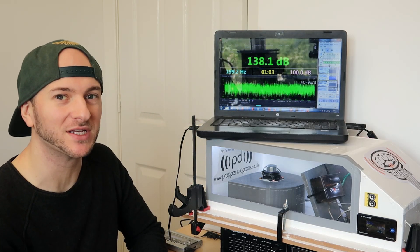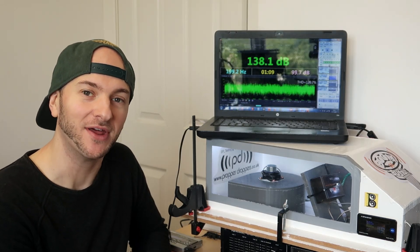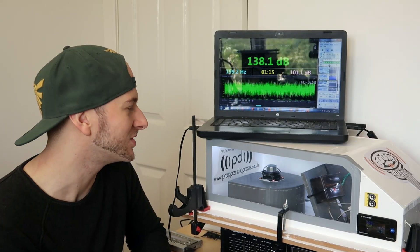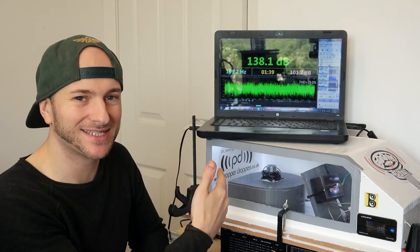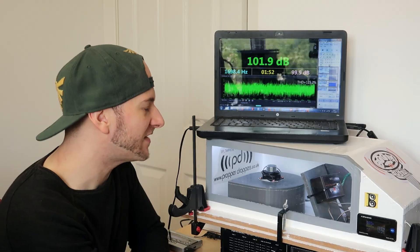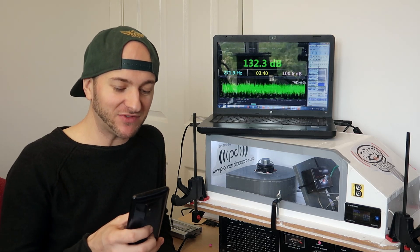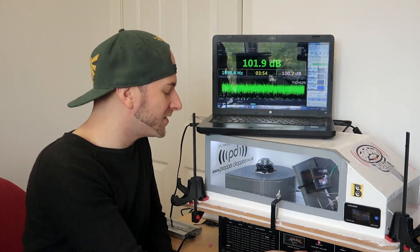There's 15 watts and a 138 — so it looks okay, but it is technically like 10 dBs down. That is wild. The cabin is going to be really helping out that lower frequency. Some of the other really loud boxes we've had are equally as loud or louder at this next frequency up, so this is not looking too promising for the average. Next up is 45 scaled Hz: 15.7 watts and a 132.3. This last frequency at 360 Hz is probably way above what this box wants to play.